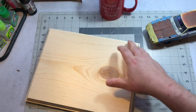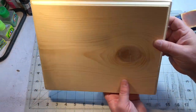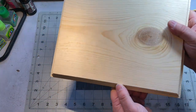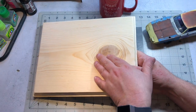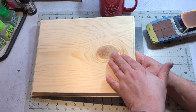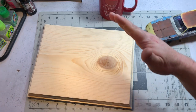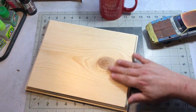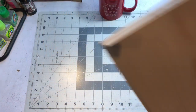And this one is one that my dad made. We just bought some lumber at the local hardware store. He cut it out and routed it. So, simple little base. Now, when I go to paint the artwork on something like this, I want to take care of these knots, and I'll just fill it with filler, sand it, and then throw my primer on there and sand it just to make sure I got it all smooth so I don't have a knot sticking out if I'm doing some nice artwork.